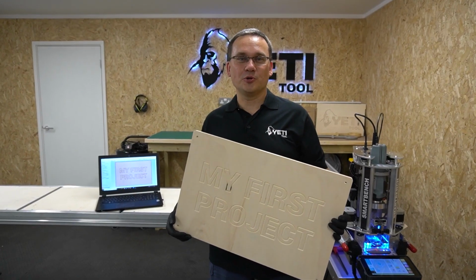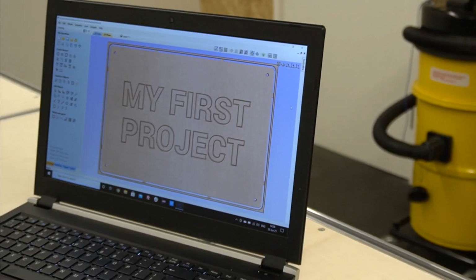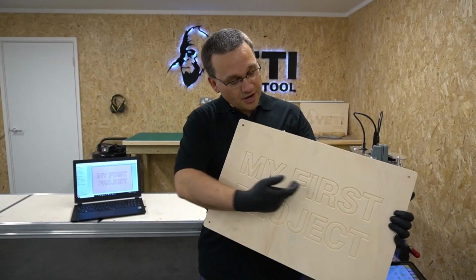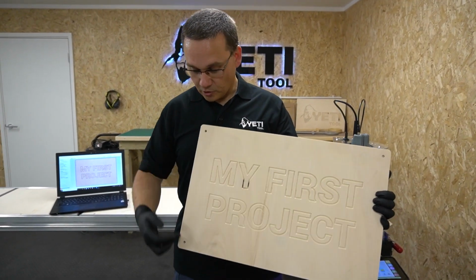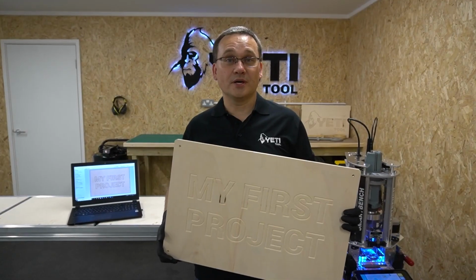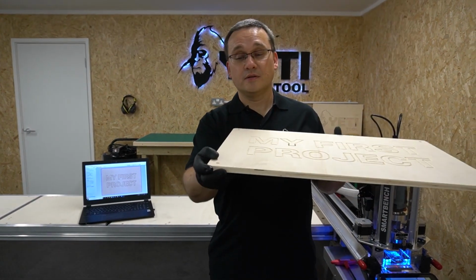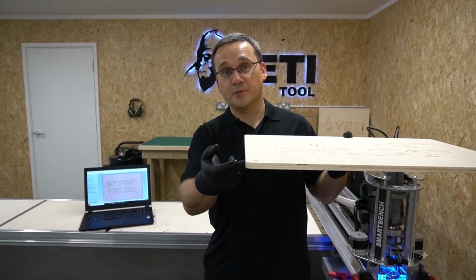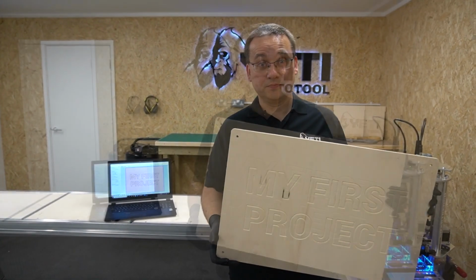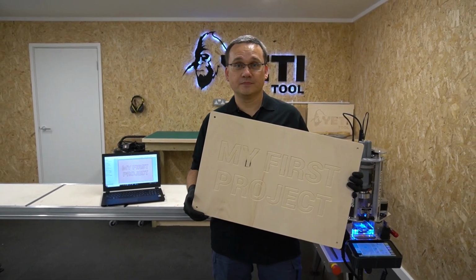In this video, I will show you how to create some job files to cut this sign on the SmartBench. We will be using Vectric for CAD/CAM, and the toolpaths will include engraving the text, mounting holes, and contour of our sign. We will be cutting our sign from the 12mm thick plywood. We will set the Z datum at the bottom of our material, and we will use two tool changes to achieve this. Let me start by showing you how to define the job setup in Vectric.